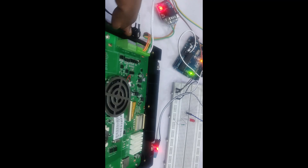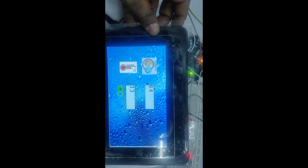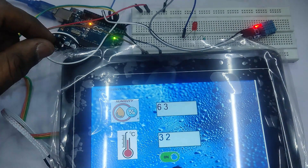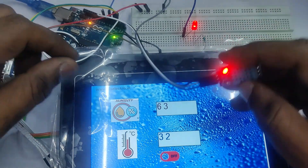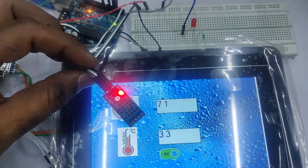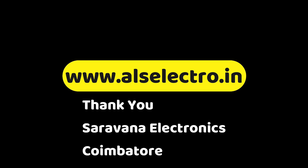If buffer 8 is 1, it will switch on the relay. For switching on the relay we give LOW, as we are using a low-enabled relay. Here we used an LED, so the LED will be off in that condition — it is reverse logic. Otherwise it is on. Now upload the code. The actual data is now displayed on the DWIN display — humidity data on the top, temperature data at the bottom, and the on/off touch button is working. The LED on/off works in reverse as we have given reverse logic: LOW to on, HIGH to off. If you rub the DHT11 sensor you can see the variation of humidity and temperature data on the display. This is how we display data onto the DWIN display. The next video is on displaying float data.